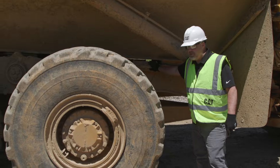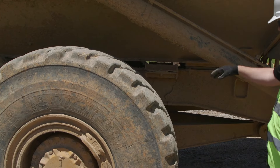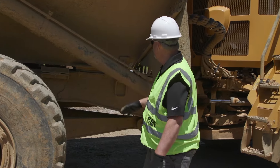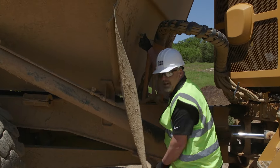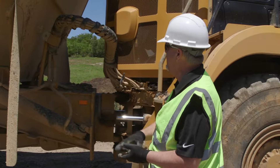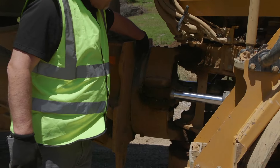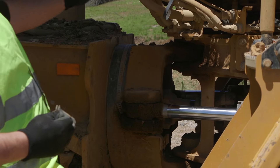Also, right here are my steering locks. They're bolted onto the frame of the truck — there's one on this side and one on the other — and they'll bolt right onto the steering cylinder to keep that truck from articulating during transport or when mechanics need to work in there. Always want to check and make sure those are in place. Coming around, I'm looking to make sure I don't have any damage to my mud flaps. I've got a little keeper here to pull the mud flaps up during transport on the lowboy. Also, I want to look at the rubber seal coming across with the band on that hitch — I always want to make sure that's in place, keeping dust and debris from getting inside that hitch and causing excessive damage.